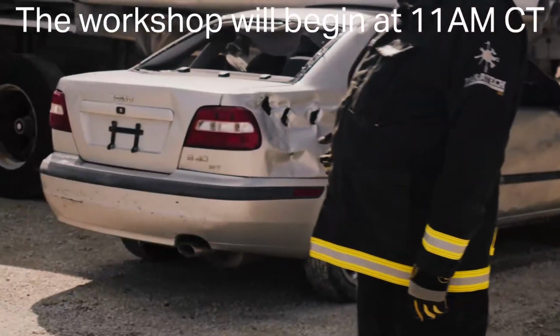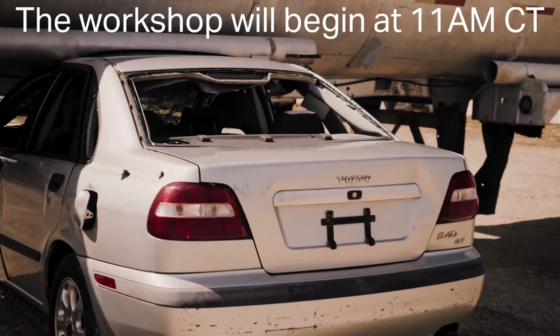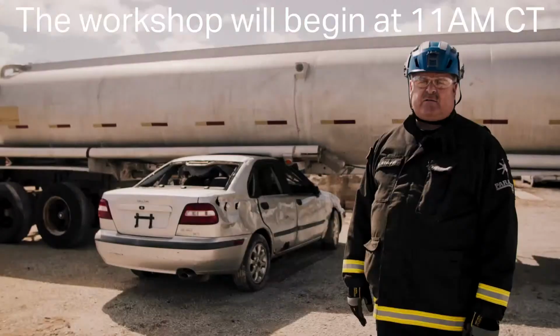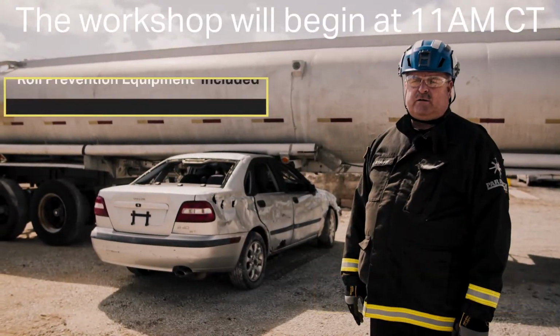We're looking at heavy vehicle versus light vehicle underride. We're going to go over what we can do to help the patient in the smaller vehicle with the large vehicle resting on top of it. First, we're going to stop the crush so the heavy vehicle doesn't sink further into the smaller vehicle. Block out the suspension, block out the truck from rolling any further.